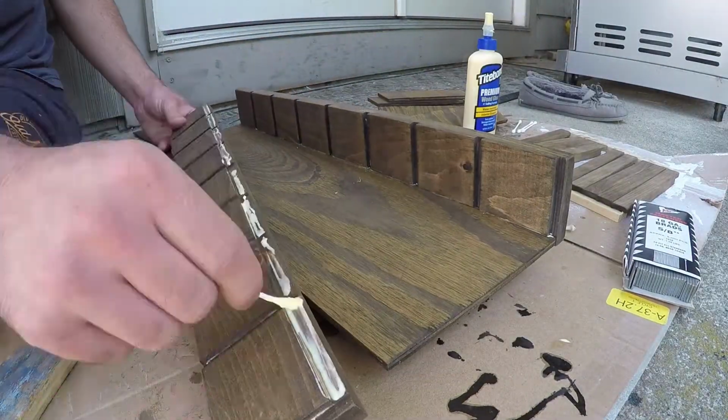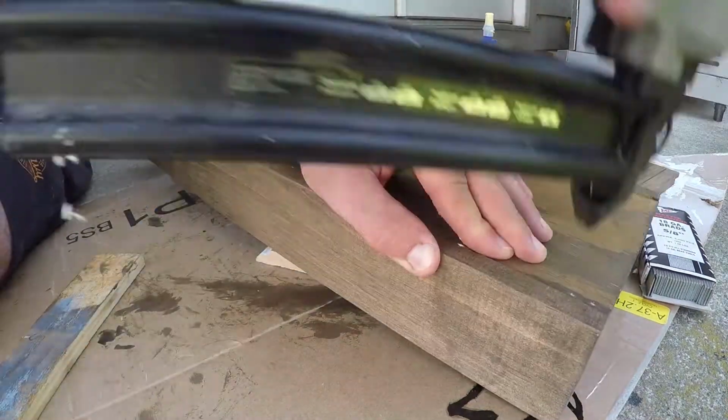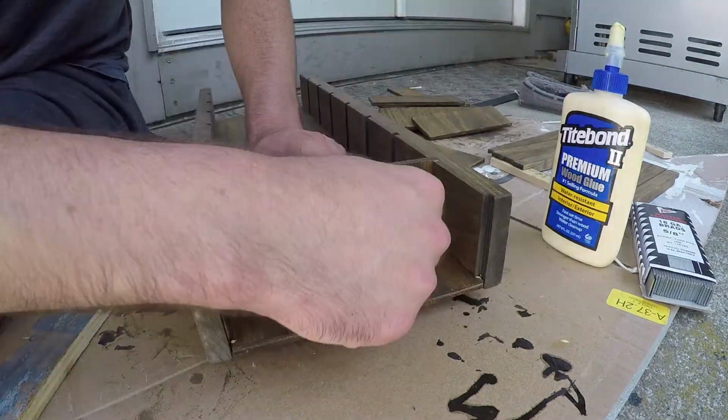As you can tell, this side went a lot smoother because, as I said, I already figured out how to do it using the first side. With the two sideboards installed, I then dry fit one of the shelves really quickly, then glued it on 3 sides and put it into the rest of the assembly.